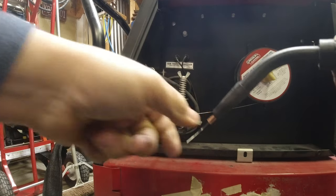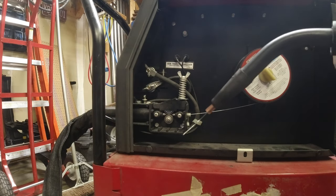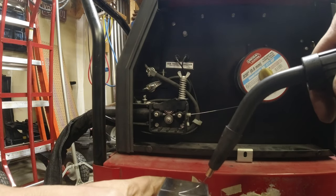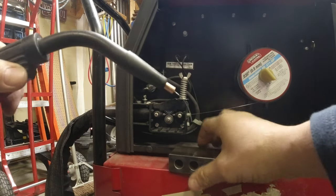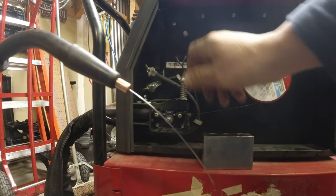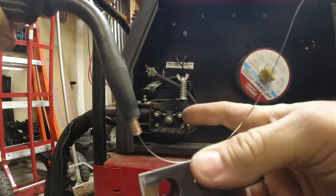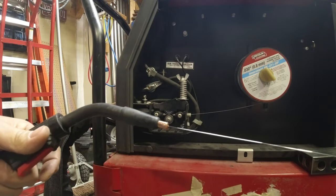When you're setting your tension, just put a small bend to the flux core wire — it breaks real easy. Don't touch these wires, they're very hot. We'll do about two inches of stick-out, hit the trigger. It wasn't wanting to push at first, so we gave it a little more tension. Remember it's got a feed — it's pushing the wire, and it was coiling. Now it's pushing properly.